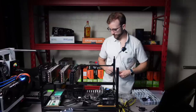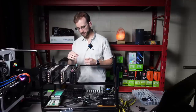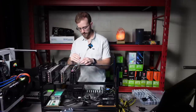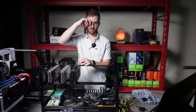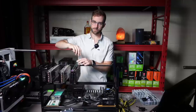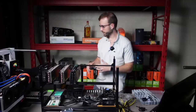So back to power again. I got the HP server power supply in there. This whole thing is going to run on 240 volt on a 30 amp PDU. So that means that HP server power supply can run at 1200 watts. If you're running it on your standard house outlet — that's a 15 or 20 amp — you're only going to be able to run that at 900 watts, which informs your 80% rule and how much you can put on it.